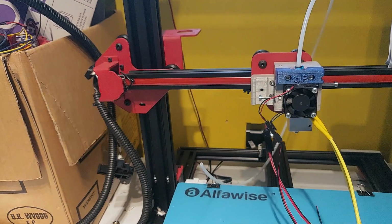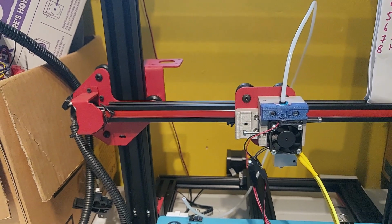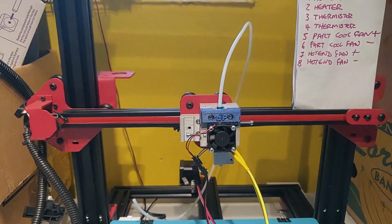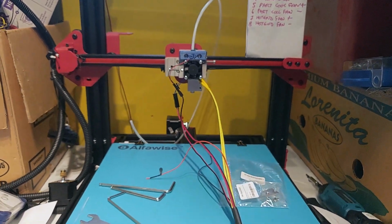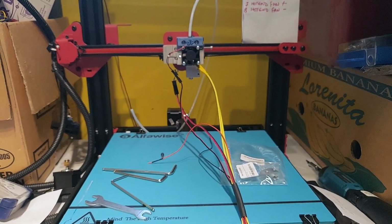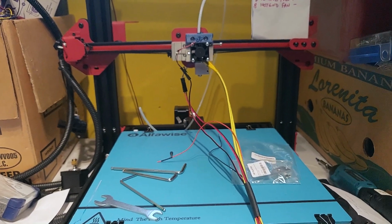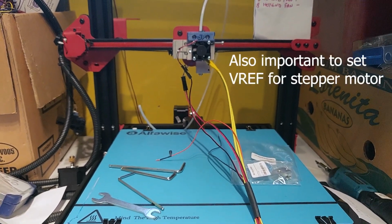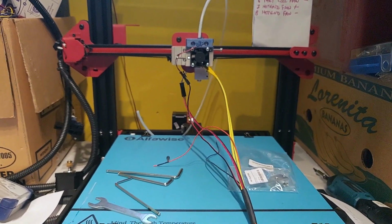does run reverse from a normal extruder, so e3D does say to change it in the firmware, change it so that it's an inverse setting, but because this is closed source software or firmware on here, and I haven't flashed Marlin because that's still in development, I will just be swapping 2 wires over on the extruder plug, and then doing it that way means that I should still be able to use it. I'll try it, see what happens.